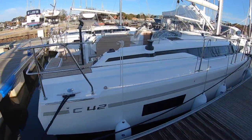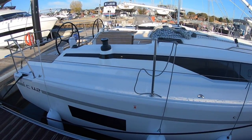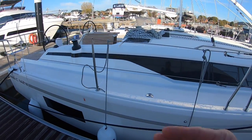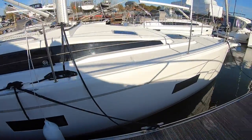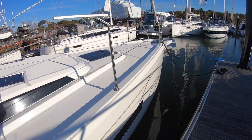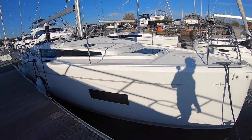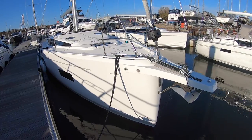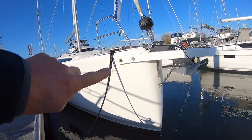The chine also gives a powerful hull shape with plenty of space back here for the aft cabins, and you get the flat surface for these large hull windows. And then look at the forward end — look how much volume is incorporated into the bows. That really is a bit of a game changer. You can see how bluff that bow is, how much volume there is up at the top.